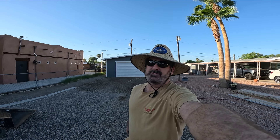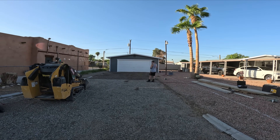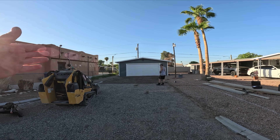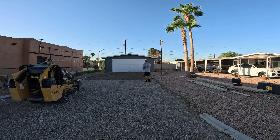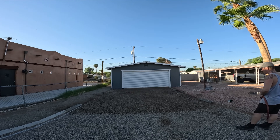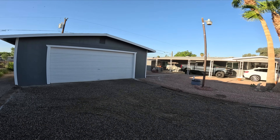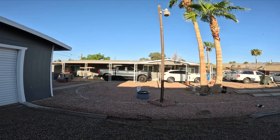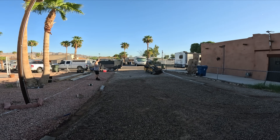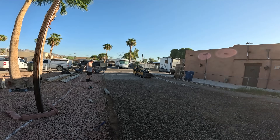Alright, we've arrived at a new job site location. We're going to be doing a driveway here, and also another carport in front of the existing garage — so it'll be like a drive-through, a little offset. It's going to start in line on the left side of that garage and come over about 18 feet. It's going to have a typical one-by-one footing. We've got to get inspection on it — two half-inch rebars, one top and one bottom, wire mesh in the middle, expansion bolts to hold down the metal carport with bottom rails that come down on the concrete. We'll have slope on it, probably about two to three inches in 30 feet.